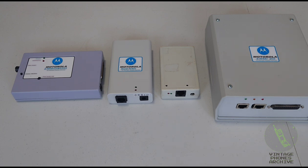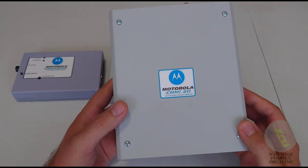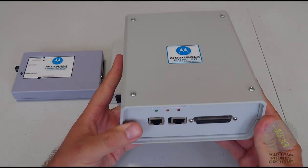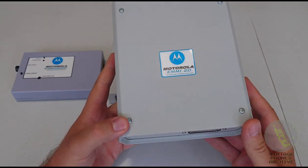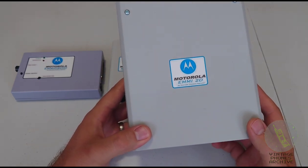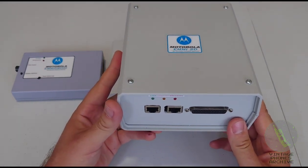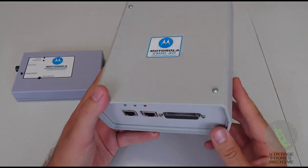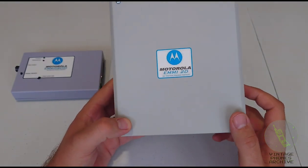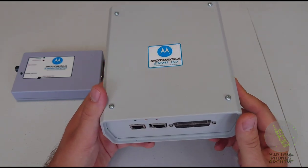This interface basically was made by Motorola engineers as a way to communicate with Motorola phones back in the 90s, because the only way to communicate with them was through serial or parallel ports, and their speed was pretty slow. So they made an electronic man-machine interface for faster speeds and also a way to communicate with the microcontroller inside the phone.